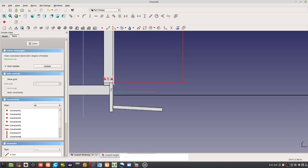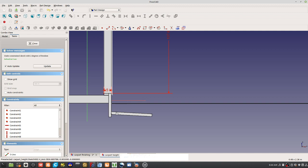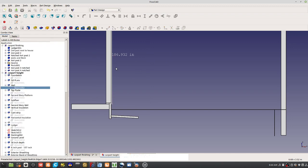And there's our insulation on the side of the house too, and then there's going to be more insulation, which is the shallow frost protected footer. That means this is as effective as if you had sent this insulation down into the ground, but you're not digging. So this is an effective way to do insulation without digging too much. That's easy, because otherwise you'd have to have a backhoe to dig a much deeper, 3-foot trench. But that's the basic shape.